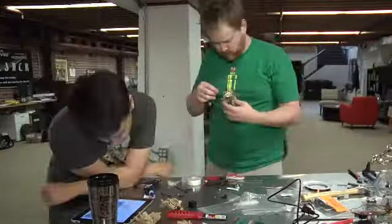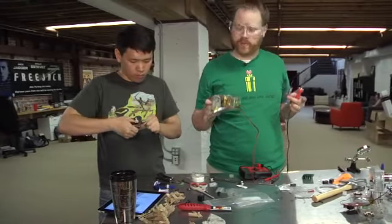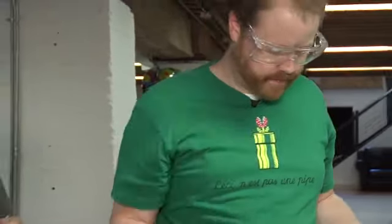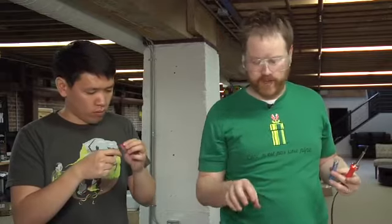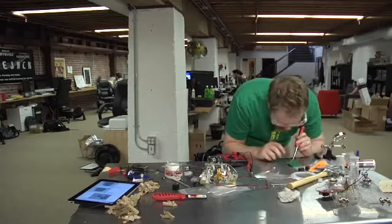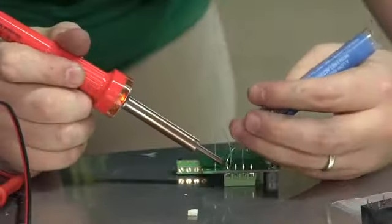We built the plastruder assembly and everything looks pretty good. We're going to use the electronics from our old board, so that stays the same. But there's an addition — we have to add this relay board because the new heater draws a lot more power than the old one, with these two big resistors. This relay board involves a lot of soldering and small fiddly work. The other board will turn this one on and off and tell it when to supply the big power to turn the heaters on and off.